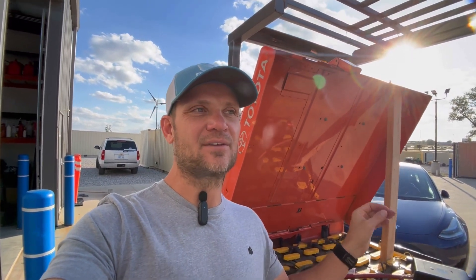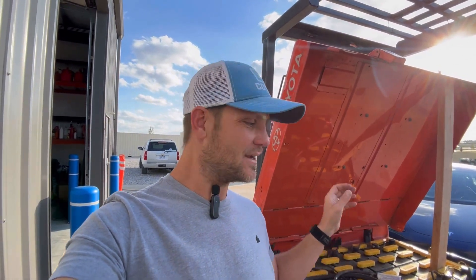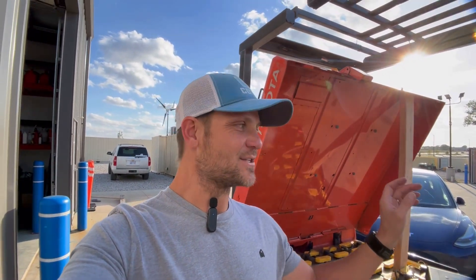So then we were in business. Now I've got the 36 volt cheapy charger going at the correct charging terminals — the 36 volt bus bars on each side, negative and positive. We're currently putting in 14 amps at 36 volts and looking for this thing to get up to about 40 volts. The most exciting thing we found out today was the forklift works — it looks like we've lucked out again. I turned the ignition on after four days of off-and-on charging and the forks work, the forklift goes forward and reverse, everything sounds great. I looked under the floorboards and no one's monkeyed around with the wiring.